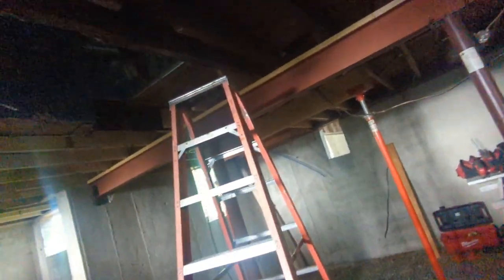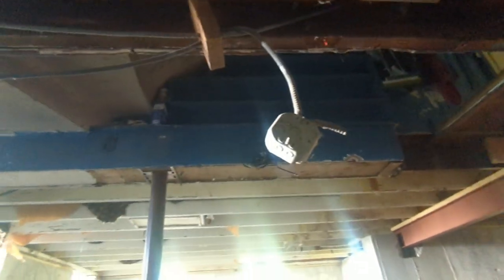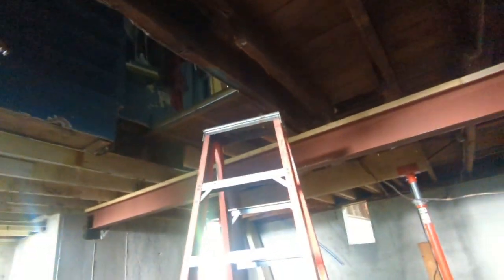So, my new plan, I should put a new 2x8 on either side of this one. So it goes right on by there, and it goes right over here. And so that becomes the heavy edge of this opening for this stairwell forevermore. The wall really isn't built on that still. It's built on this 3 to 4 inches out here of the floorboards hanging, cantilevering off of this.